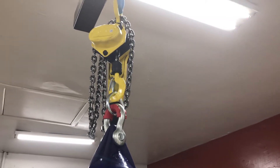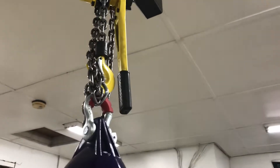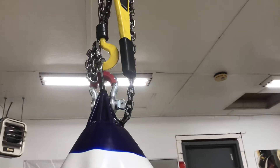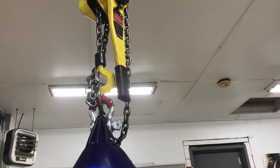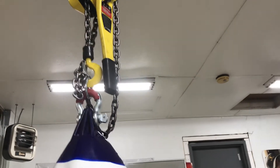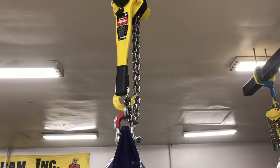I took down the other stuff because even though they carried a load, they weren't rated for holding a load. That's how the old chains were wearing out — they're not grade 70 or above. I couldn't find grade 80 or 120 at first.